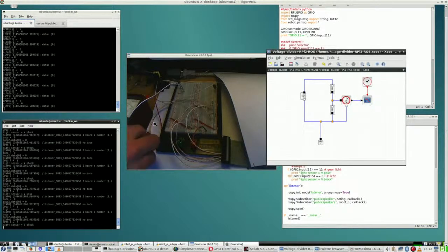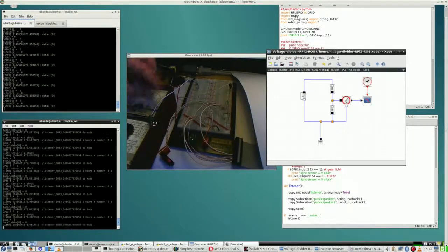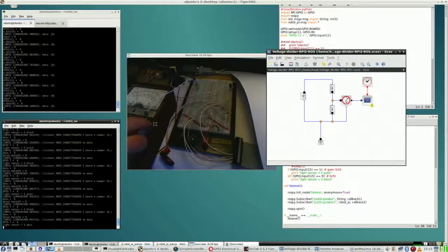does it actually work? So in comes the multimeter again. This is the wire, and this is again the flashlight. So let's measure it. It's 4.5 volts. Last time this actually proved to be working. The question is, is it working now? And I do have my doubts somehow.